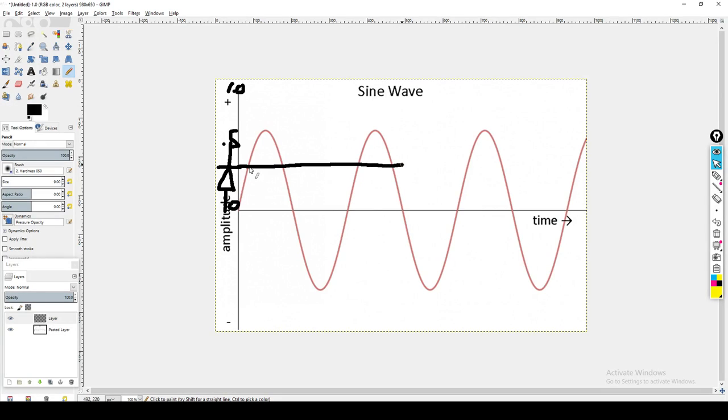So that means that the signal is going to go up, and then right when it hits this point, all of this is going to get clipped by the diode. And then everything else is basically going to get shut off here, and it's going to get clipped. And then once it comes back down, it's good to go. And then again, this whole part of the signal is going to get clipped off and all the way on through. So the forward voltage is a pretty important thing to understand when you're talking about your diode. This is determining the point at which the clipping is going to start happening. And we're going to come back to that a little bit more and refer back to that. But just remember that with the forward voltage, however high or low it is, that's pretty important to where we're at in the signal.